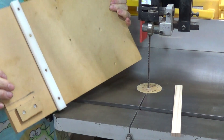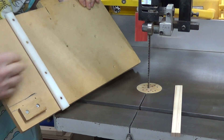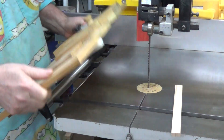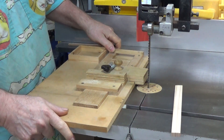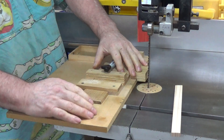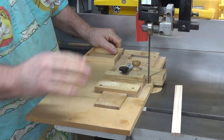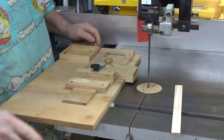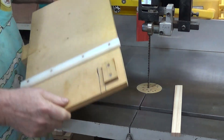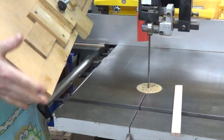The jig is basically made up of a piece of 16mm MDF with a runner that fits into my miter slot. That runner is placed according to where the blade is located. The jig is pressed into the blade and under the jig there is a stop block that stops it. That stop block also has to be positioned according to the individual's runner.